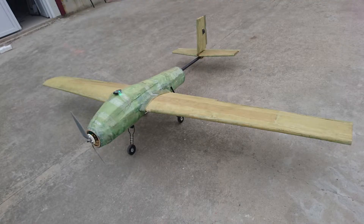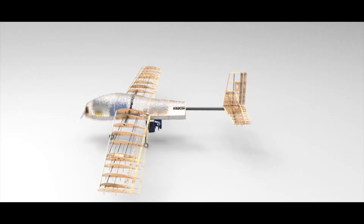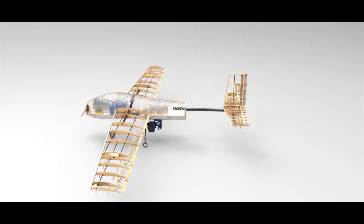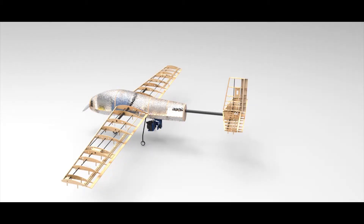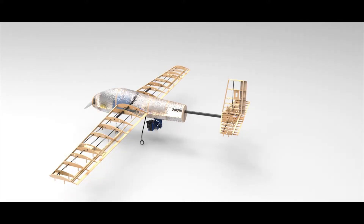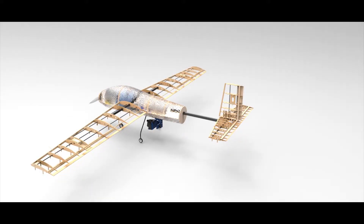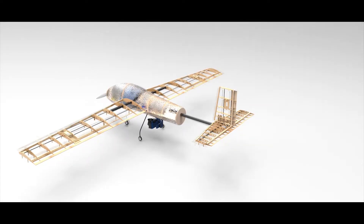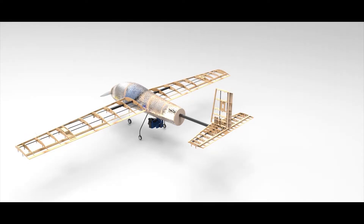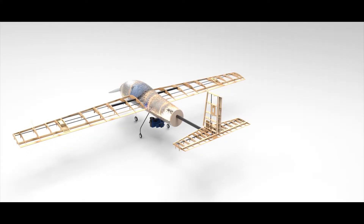The total design consists of balsa and birch wood, but wood alone wasn't enough to make a stable, high-strength aircraft. We strengthened the whole structure using spars — high-strength composite spars that give strength with minimal weight. There are three spars in the wing design: a leading edge spar, a trailing edge spar, and a middle spar. The spar diameters are 6 mm, and one 22 mm pipe is fixed inside the wing structure, connected with a 20 mm pipe passing through the fuselage.